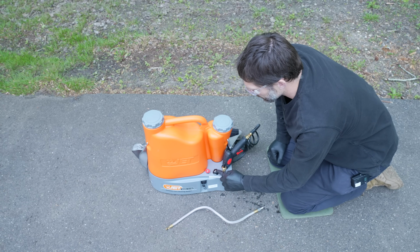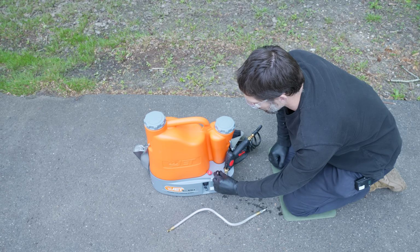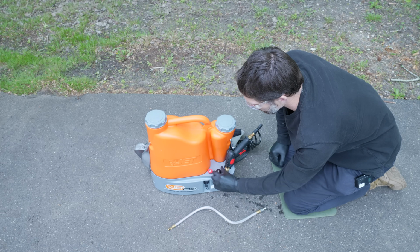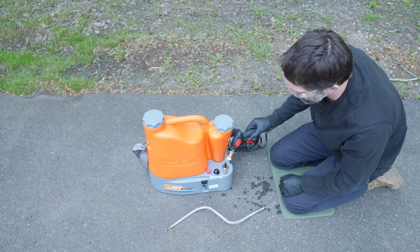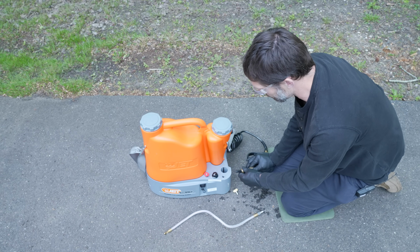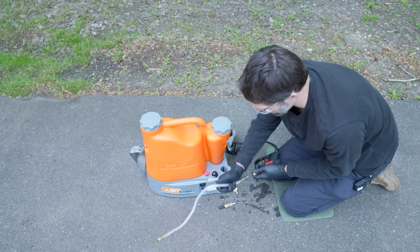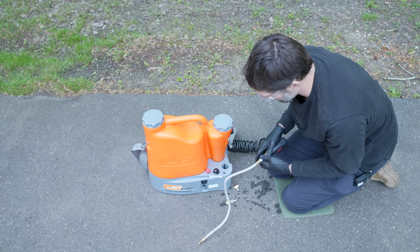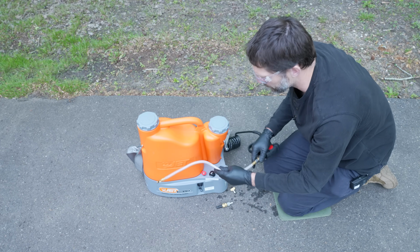So now we're going to turn this knob to 20:1 for the indoor coil, so we take 1 revolution, that's 1, 2. So that's 20:1, and we're going to use our bubbler again on the inside, so we can just add this in. We're also going to be using this little extension, which is flexible, and that can get into hard to reach places.